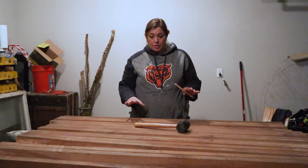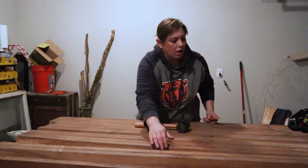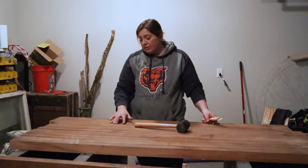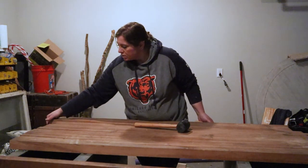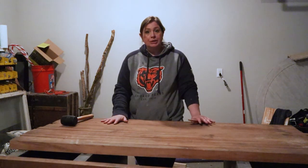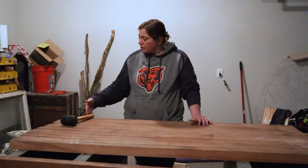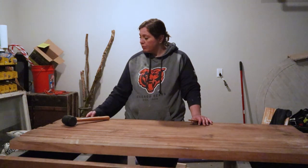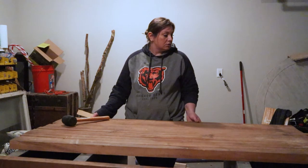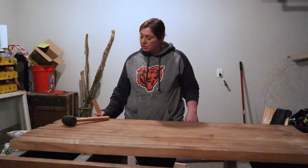Now all of these boards are ready to mark. There's a lot of finishing work that will need to be done just to get years and years of grime off of this board. However, what's great is that they're all pretty well planed and they've got really nice thickness to them, so even when I sand it down it won't get flimsy. What I'm going to do is clamp these all together and then mark out where all of the biscuits go. Typically you do it at least 6 inches from the end just in case you want to trim them off. Typically it's every 6 to 12 inches apart, depending on which biscuit you use.